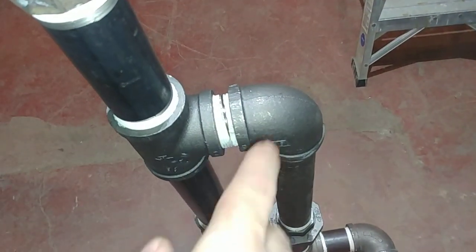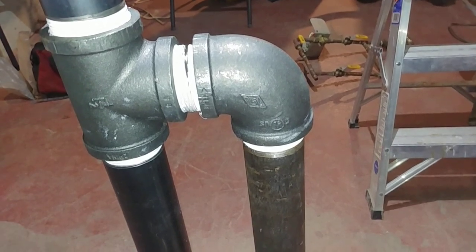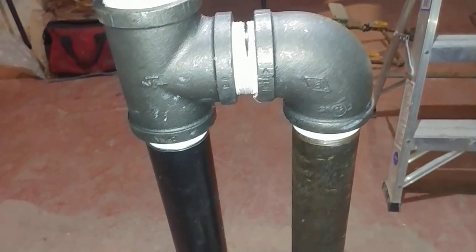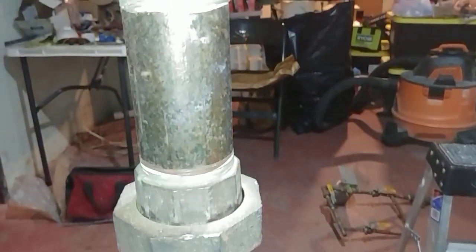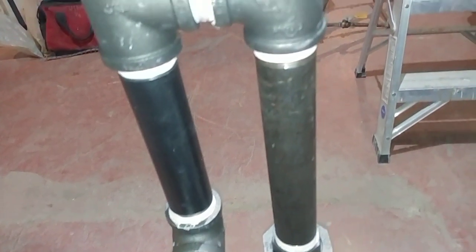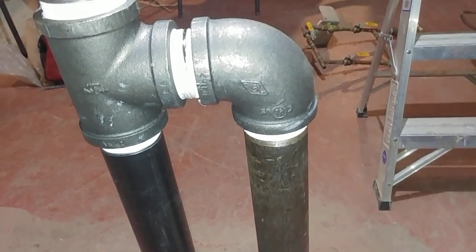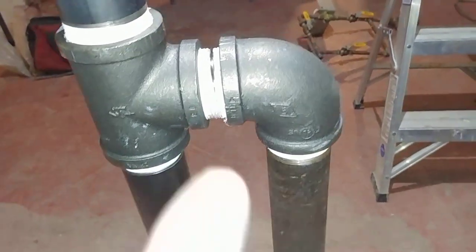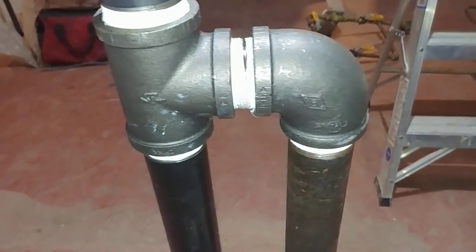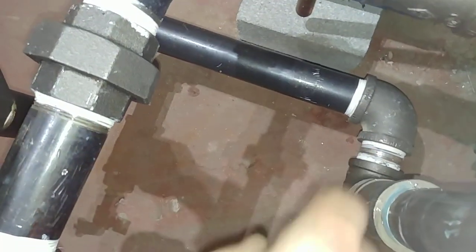This is where we're feeding into the boiler on the return line — the equalizer return line. We've got a brass bushing to transition there, and on either side we have stainless because we're going to have possibly aggressive water there. I want to reduce the corrosion. That's one of the last of our extra heavy nipples and then we transition to regular. The shorter nipples here — this is the Hartford Loop. You probably could have gotten away with one inch going into this inch-and-a-half T, but that nipple there is stainless steel, likewise with the shorter ones.